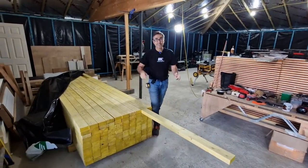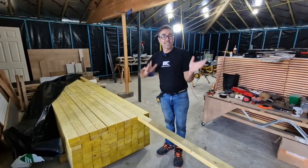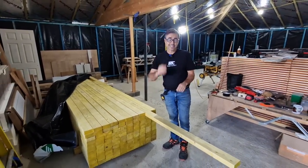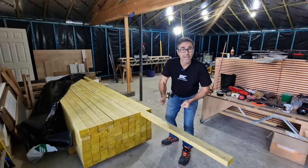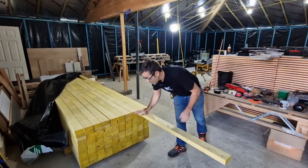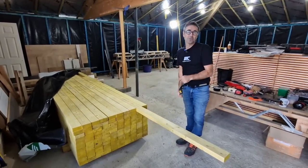If you do carpentry and joinery you get delivered a pack of timber, and if you've got a hundred pieces, ten or twenty aren't going to be good enough for doing straight studs. They're going to have to be things you can pull in and out and fix, like noggins, heads, and sole plates. I don't have that problem — I'm going to get on and build this stud work.